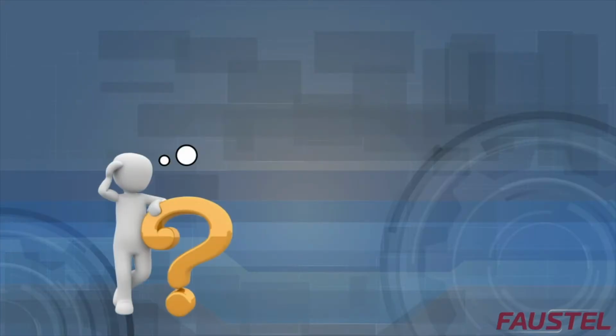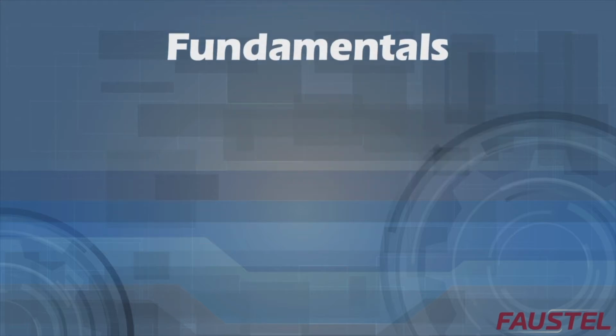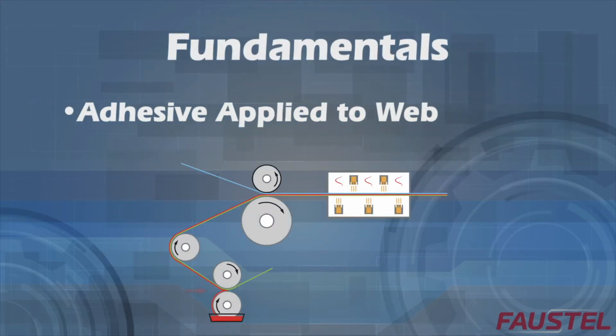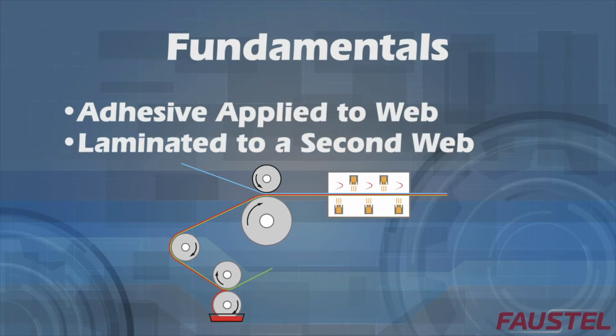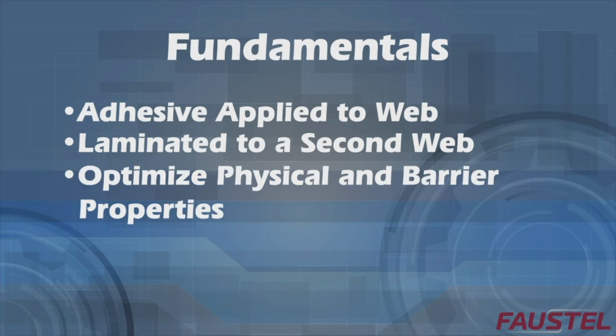Today's Tech Talk is on the wet bond laminating process. Let's start by defining the process. Wet bond lamination is a process where liquid adhesive is applied to a non-porous substrate and then is immediately laminated to a second substrate via a nip. The main purpose of constructing a laminate is to optimize physical and barrier properties.